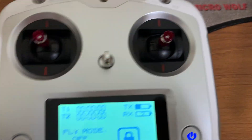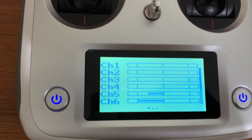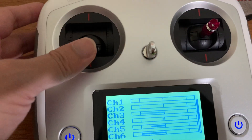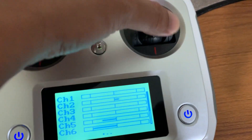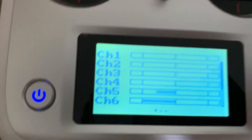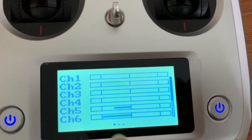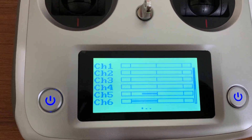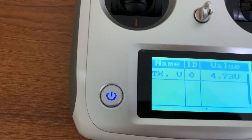There are a number of settings to go through after powering up your device for the first time. On the interface you can see the channels — by default four channels are activated, and auxiliary channels can be activated manually from the setup. As you deflect the gimbal sticks, you can see their movement through the channel bars, and you can check which stick is assigned to which channel. I've mixed channel 5 and 6, which is why you can see it deflected from its main position.